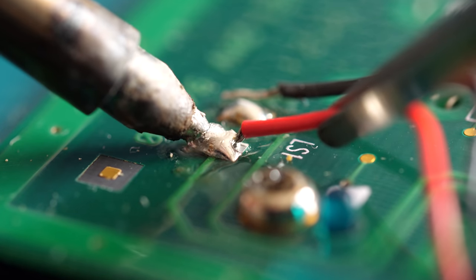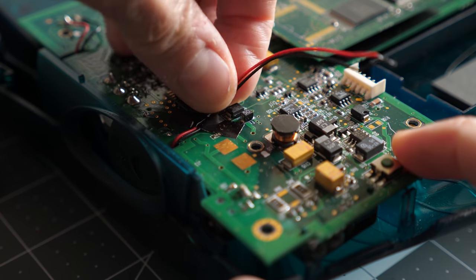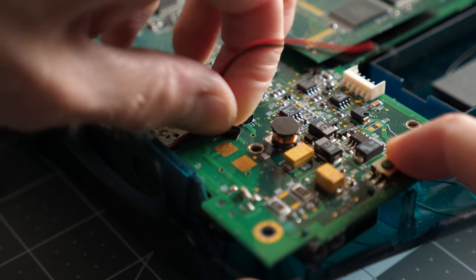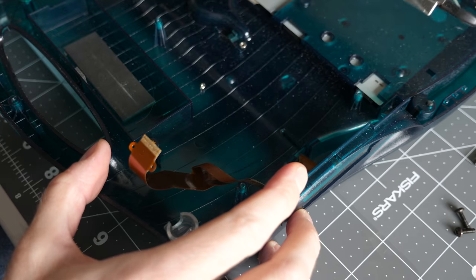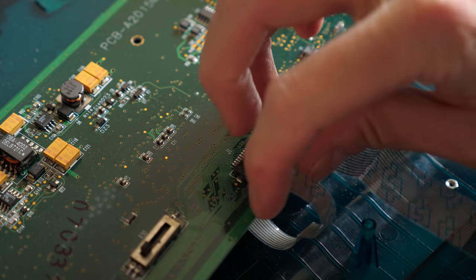I suspect these were soldered to the board for two reasons. It would help reduce manufacturing costs slightly, but also, since durability was a concern, it would eliminate the risk of a connector coming loose from rough handling. The underside of the board has a pair of connections for the keyboard ribbons, which I got unlatched and disconnected.